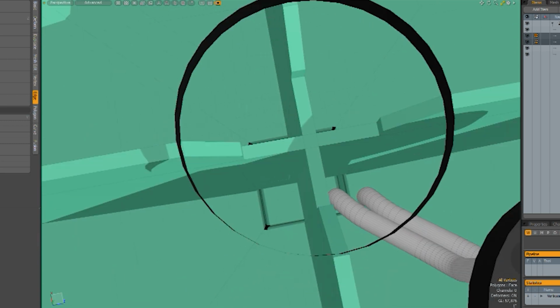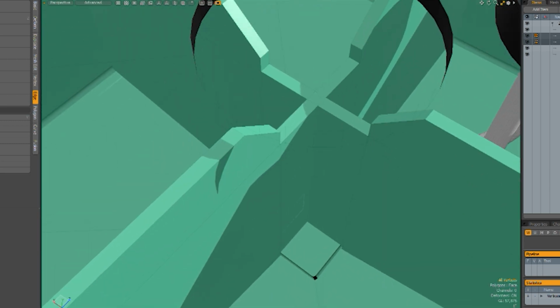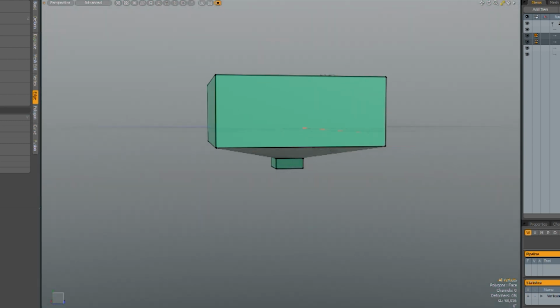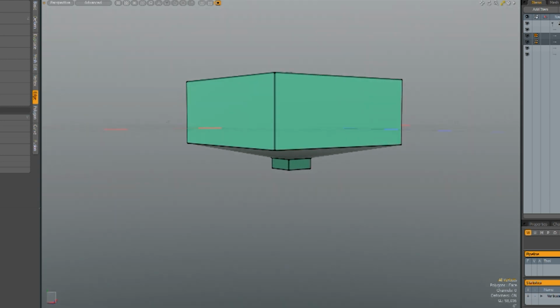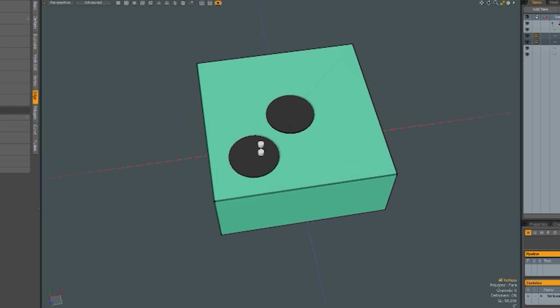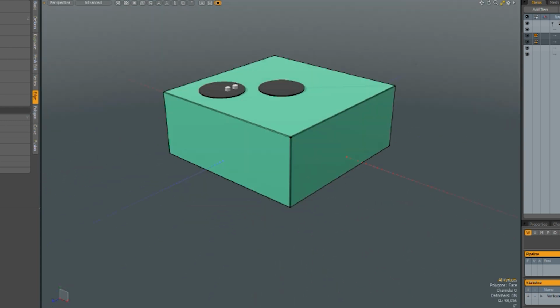And we can, of course, suck down right to the sump and get any last bit out of there as well. So that's the concept here, is that we have this tank with these sloped sides going down to this sump, and we can pull from either higher up or lower down depending on if we're using fuel and we don't want to collect debris into it to clog up our engine.